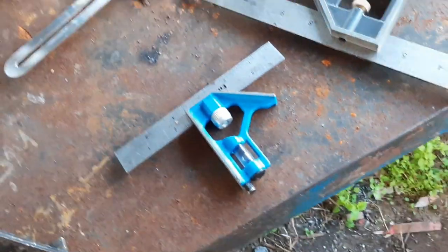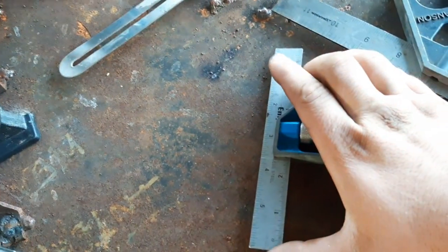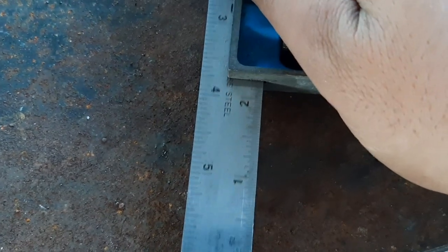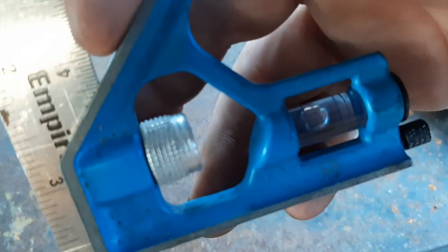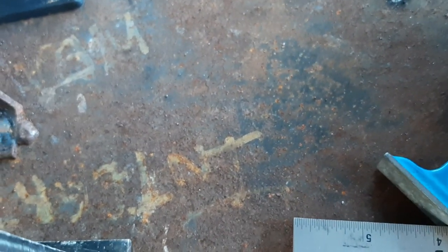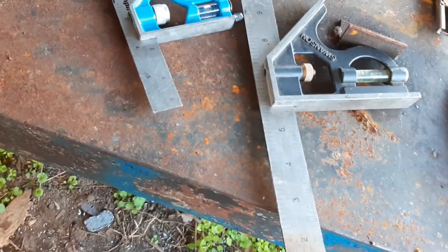Combo squares — oh goodness, I love-hate combo squares. Really good contraption. Check this out — you can slide a little ruler back and forth for extremely, extremely precise measuring and then lock it in place. It even has a little built-in level just in case you need level. It also has a little hardened steel scribe on it. The scribe I really don't use because it's useless for steel — probably works really great on aluminum and other things like that. I have two different varieties and I keep both of these on the truck, just as I have two varieties of speed square now.